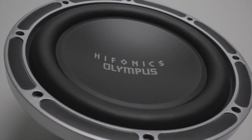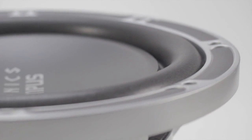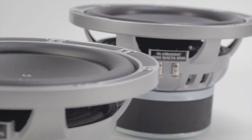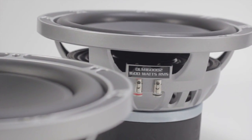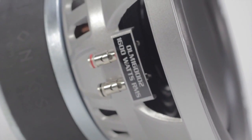The OLM-1600 features a one-piece pressed paper cone and dust cap, a uniquely designed foam surround, a reinforced cone neck joint, and an optimally spaced dual spider design that provides control for 19 and a half millimeters of linear excursion. It also has an ultra rigid aluminum die cast basket with polished gray finish and nickel plated push and insert speaker terminals.